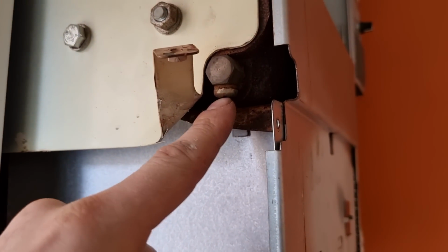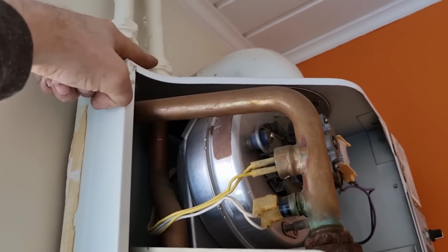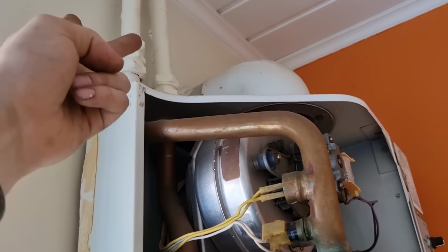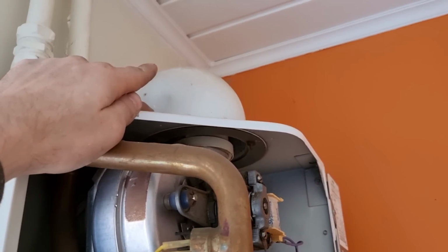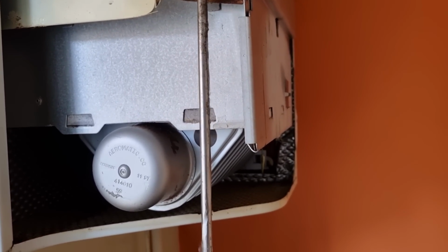And there's a drain off tap here on these. Unfortunately they haven't put one on the pipes. I think that's the return on these. I'm sure they're labelled on top, and that's the flow, and it's flipped on the back seat, so we'll have to cross them across. So we'll get a bucket in, get that drained, get fluid disconnected, and get the boiler off the wall. We'll just crack this. Got a bucket underneath.